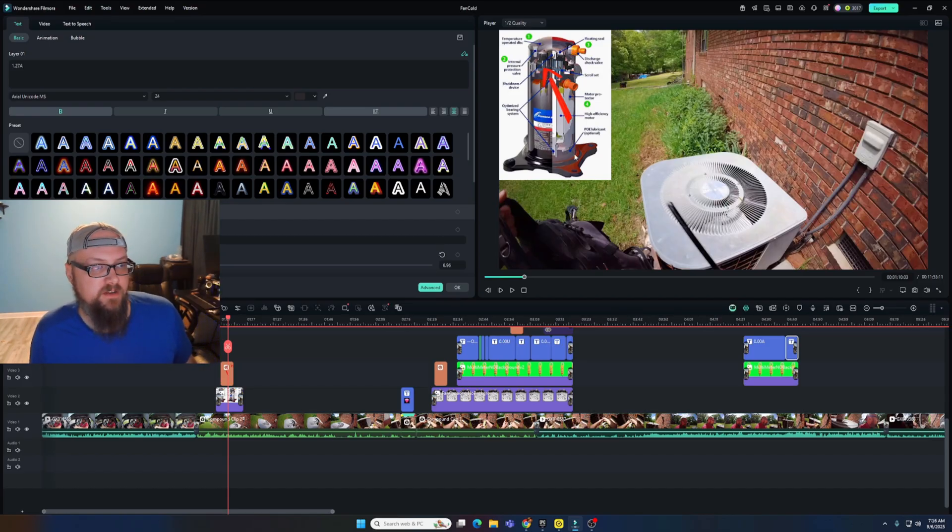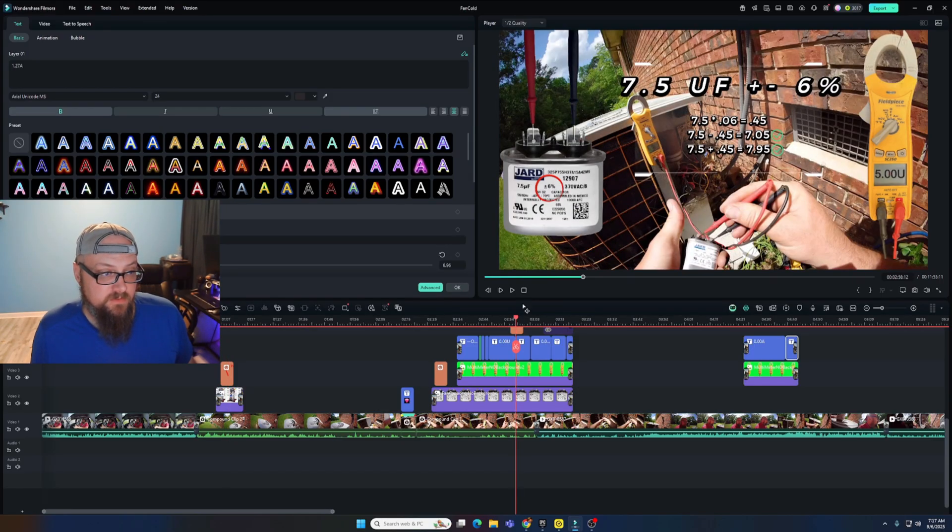You'll occasionally hear a screaming compressor from around the side of the house — they'll do that for a while but eventually they'll overheat and can be damaged. The pop-off valves aren't really made to cycle over and over, so they'll work for a while and eventually get stuck. All said and told, a fairly standard service call. We run into capacitor replacements quite frequently — charging and discharging 60 times a second in 90-100 degree summer heat essentially cooks the dielectric inside, so the plates end up too close or too far apart and the capacitance value goes way off. Anyway, we got them going with some cold air instead of just fan air — catch you next time.